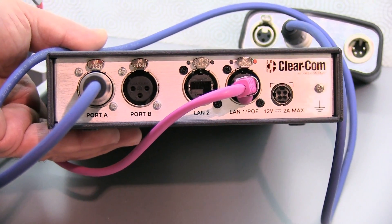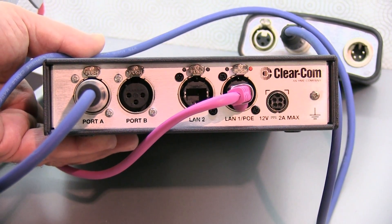This works over WAN, LAN, or the internet, because inside the box we're using the Opus codec. It's a very adjustable codec, which allows us to vary the bandwidth, the jitter, and the bit rate of the internet line per port, per send and receive.